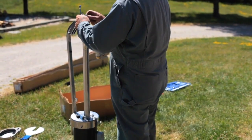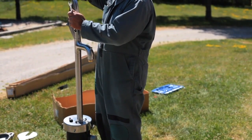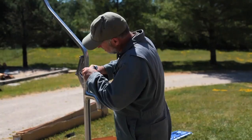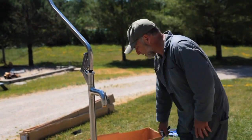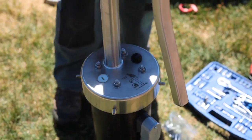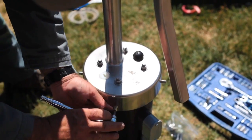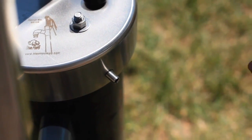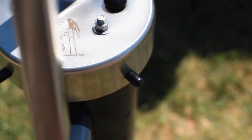Now I'm reactivating the handle — connecting that top bolt back into position so the handle is connected to the pumping rod that goes down to the pumping cylinder that pushes the water up. I'm snugging up those locking bolts to secure everything and get ready to do the pumping for the first time. I'm also putting on rubber bumpers to protect people from brushing against the lock screws.